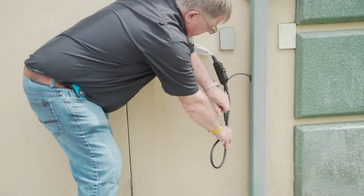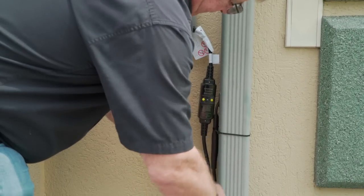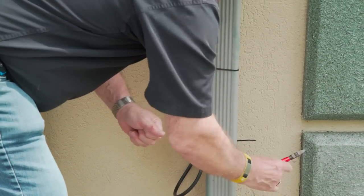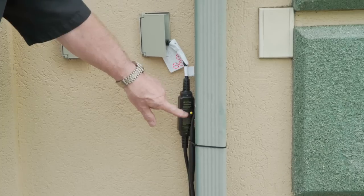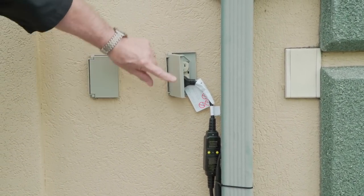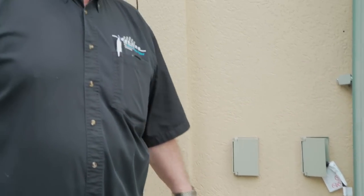Now if you have tie wraps, you can use your tie wraps to neatly manage the cable, but there you go. So it just shows you how neat a tie wrap can make a project. There's a nicely installed Paladin system into a downspout through the grommet. Ground fault protected, near the receptacle, 120 volt plug-in. This receptacle could be on a switch inside, so when the season's upon us, we just turn it on and let it do its job.